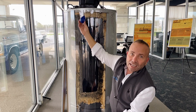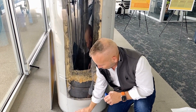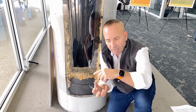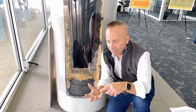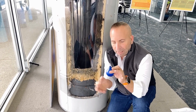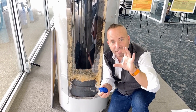Water comes in and out of the heater, and we're heating that water with a flame at the bottom — gas flames or an electrical coil on the inside. The flame heats the steel, and the steel heats the water. But when water with rock runs through, the rock pops off the water droplet, falls to the steel, and starts building a layer of rock like a brick on the bottom.